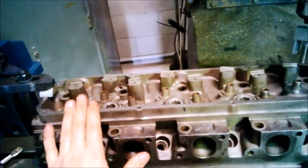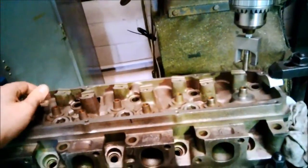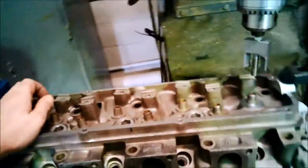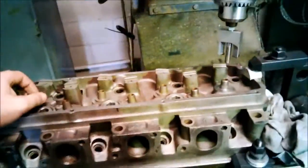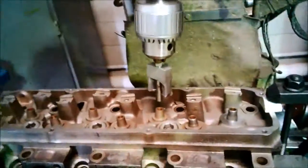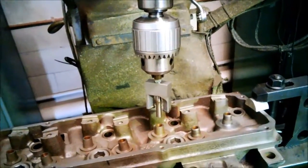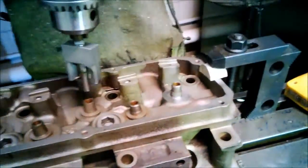For each spring seat, the install height of the spring is recommended at 1.9 inches with 110 pounds of seat pressure. I just did a quick measurement and the new valves I've got are actually too long — I'm going to have to shim up the spring seats.